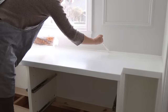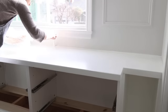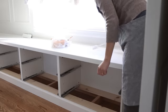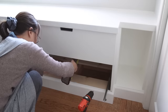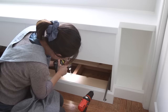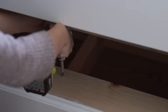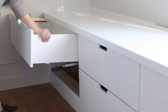I also did another layer of paint so everything flows together well — partly because I had painted the wrong color at the beginning and only realized it after I installed the bench. Before sliding in the drawers, I attached the frame to the 2x4 base. When I designed the base, I made sure there would be at least one board around the middle of each unit to make it easier to attach later.